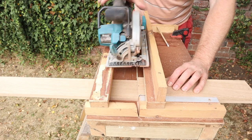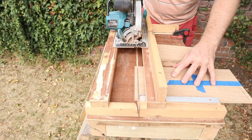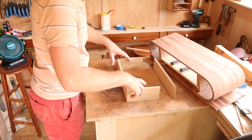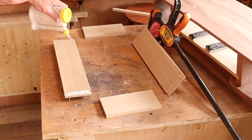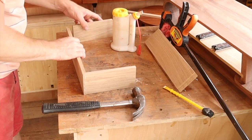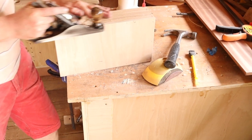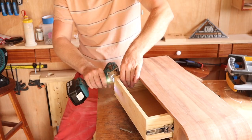I needed a drawer, so I cut some oak down into strips and then into the measurements of a drawer. I'm not going to dwell too much on how to make this because it's fairly simple - it's just a box. I used rabbets on the edges so that it's nice and smart and strong, then a bit of cross-grain chiselling. Popped it together with glue and some oversized nails - pin nails would have been much better in this scenario, but you use what you've got, and it will give it extra strength especially as I nailed the base onto it as well. If you've got the right tools for the job you might want to countersink the base in there using some more rabbets. I put these really nice short drawer runners that I found on Amazon in and attached the drawer and it went in really nicely.